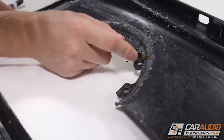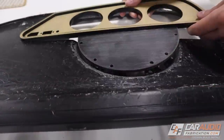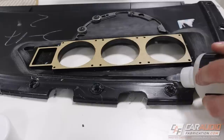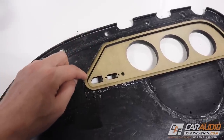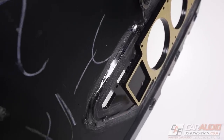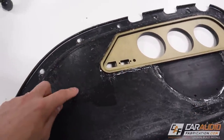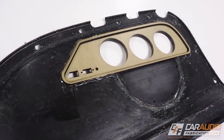I used the Plastic Bonder primer around the outside edges and in areas where the two different types of plastic material are going to be sandwiched against each other, then followed up by adding the adhesive itself and pressing the pieces together. Around the outside I need to add a little more strength with standard CA glue, because standard CA glue adheres really well to the acrylic. I've made the acrylic panel nice and thick so it sticks out on both the front and back side, and by adding a bead of CA glue on each side it creates a sandwich around the unknown type of plastic, giving us a mechanical hold on each side. Under normal conditions it's plenty strong enough to move into the body filler phase.